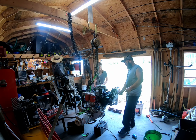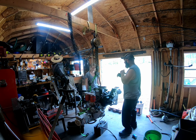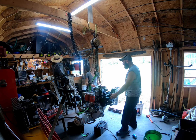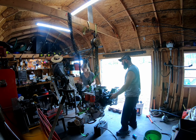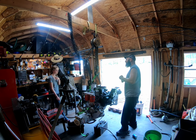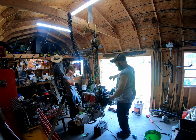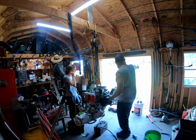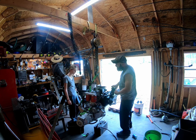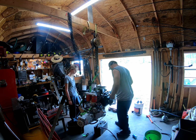You got water that runs through the manifolds, comes out of this, mixes here and spits out. Then you've got fiberglass tubing that runs the exhaust out of the boat. And the exhaust is what? Very hot. So without the water cooling the pipe going out of the boat, you would melt the fiberglass tubes. And then the riser is to get your exhaust up high enough, because there's two big holes in the back of the boat, to make sure the seawater doesn't come back into the motor. So only the water can go out. That's why they have risers.